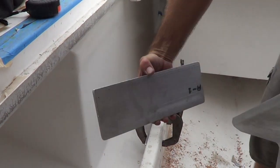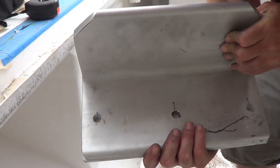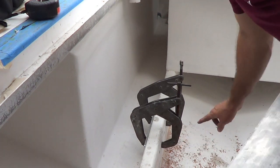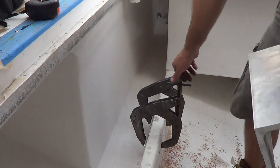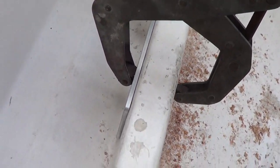We have these backing plates we're going to put on the back of the stringer. You might think I could just drill these holes to match, but since I have to drill by hand with a cordless drill, those holes - I hope - are pretty straight, but they're never going to be perfect. So what I did was clamp the bracket onto the back of the stringer and mark the holes with the drill.